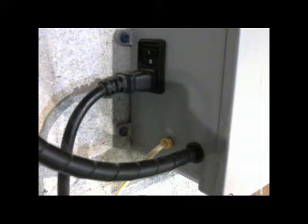How you manage these wires is a matter of choice. Please be sure everything is solid and secure — at the end of all your wires, use connectors, crimp them well, solder them, and finish them with heat shrink for added stability.